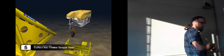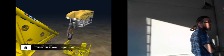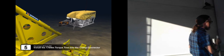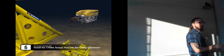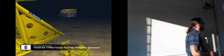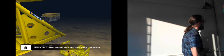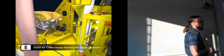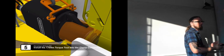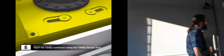So instead of having it vertical in there, if they had locked it in place horizontally inside the basket down there, he could have grabbed it in the correct location straight off. This is a situation where the ROV pilot could lose the grip on the torque tool and it falls down, so then he has to go back down and get it, and you can lose quite a lot of time just fooling around like that, doing small mistakes. But that is often a case of an engineer designing equipment and he doesn't really know how it's going to be used. So he does his best, but if an ROV pilot had been there, he would have probably told him to do it another way.